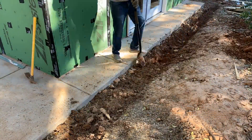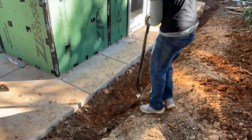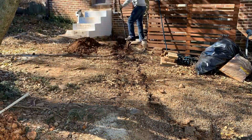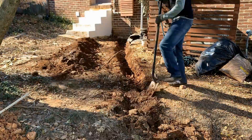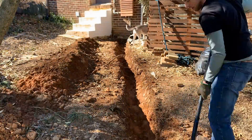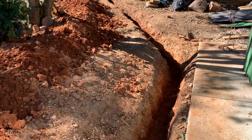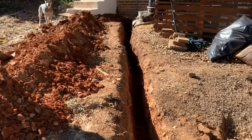The next hurdle was digging the trench for our electrical conduit. You can rent a machine for this, but I decided to just spend a day doing it all by hand. Using PVC conduit, I'm required to bury the lines 18 inches deep and to be on the safe side I'm going to be going 20 inches down. If the conduit doesn't lay perfectly in the bottom of the trench, I wanted to ensure I had a little wiggle room so I would still pass inspection.